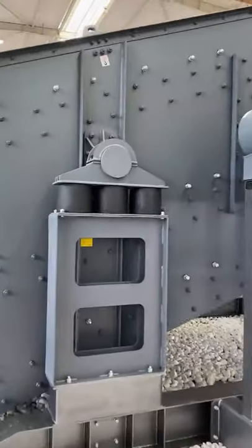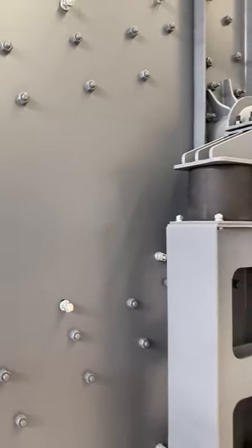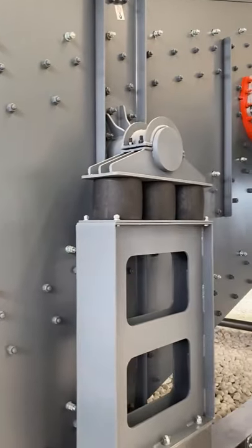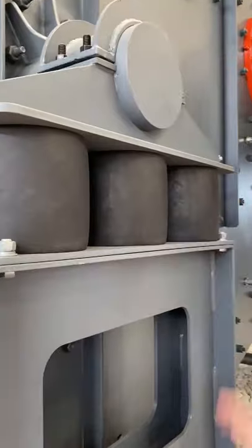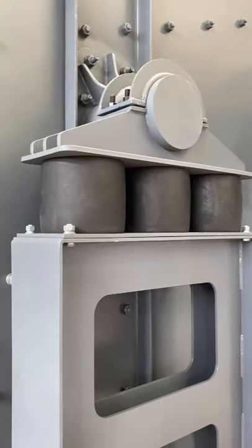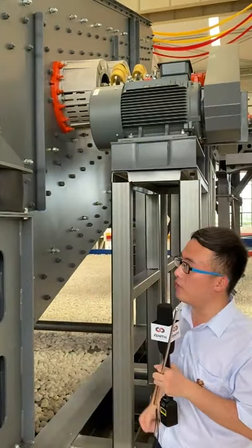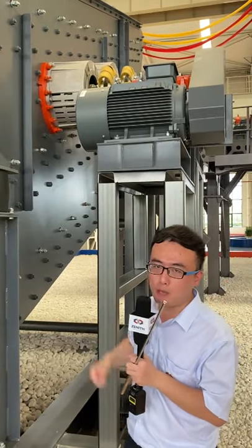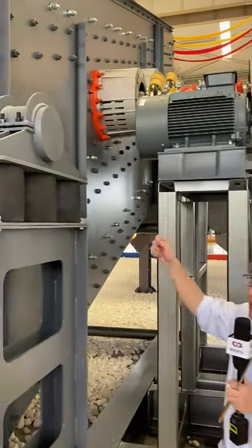You can see from the big frame that the side plates have no welding. No welding means no welding stress and no cracking risk. The three rubber springs, compared with iron springs, produce less noise and keep the machine very stable when running. They also absorb big impacts effectively.